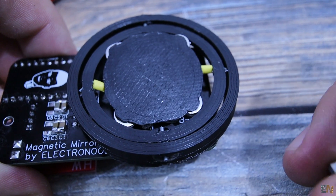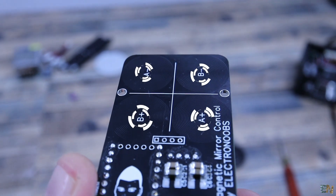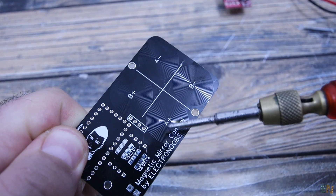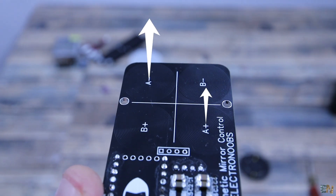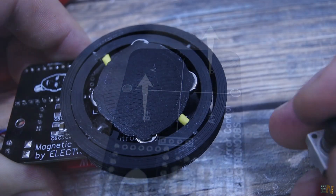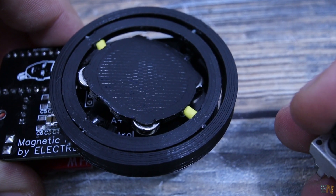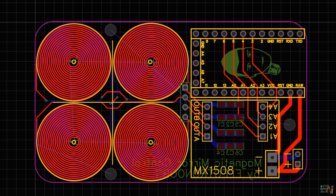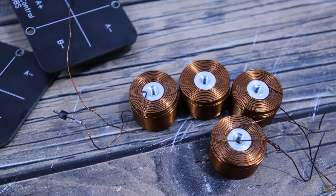That's how I want to move the mirror, but I've made a mistake. Instead of controlling each coil separately, I've connected them in pairs of 2 in series — A plus connected in series with A minus, and B plus with B minus. Like that we can move the mirror up and down or to the left and to the right, but we can't control the amount of movement. For that we need to control each coil separately so we can push the part contrary to the other electromagnet and balance the position. That's why I've changed the PCB and ordered it once again, but till it arrives we have to make some tests using external coils.